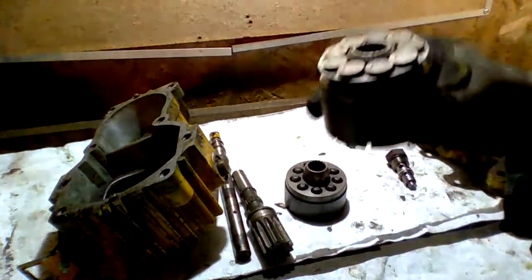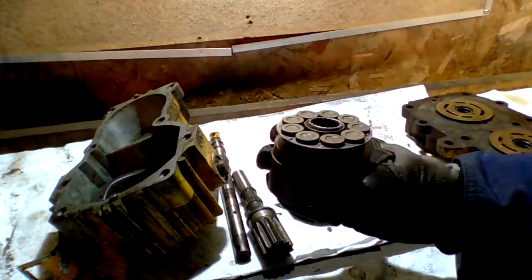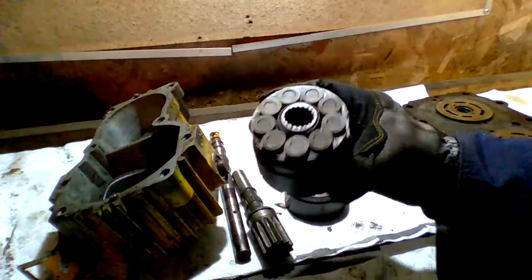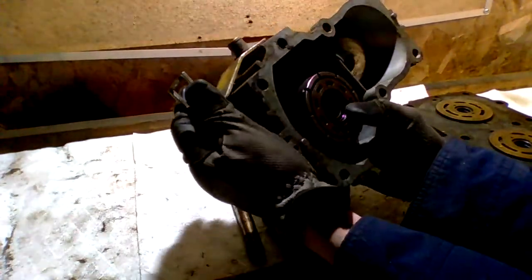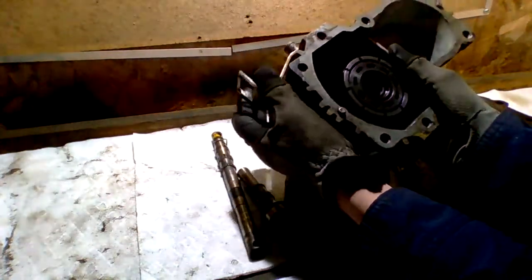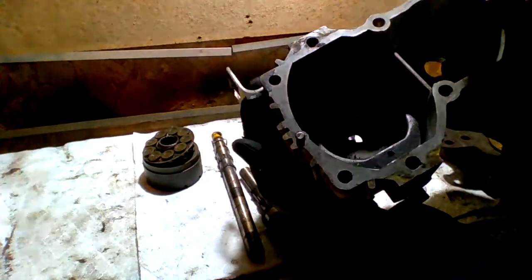This is the main pump cylinder block. There are nine pistons in there each. And what these do is they ride in this case in here — there's the shaft that I don't have installed, but they sit in there. And they are on a movable, what is called a swash plate, which changes the angle of them in there. And that's what does your forward and reverse.